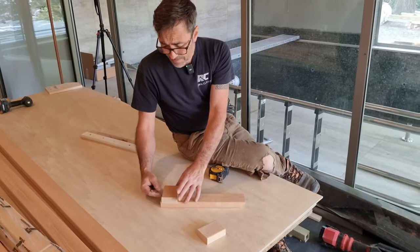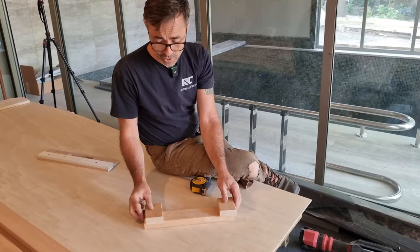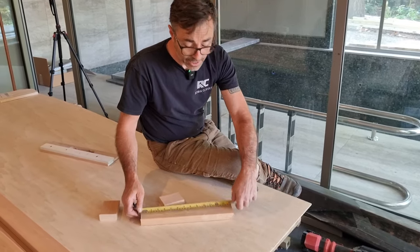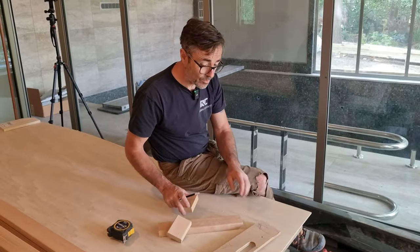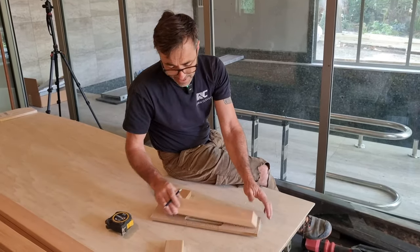I'm gonna have a little gap at the back, okay? And I wanna hang over the front, okay? So the gap at the back and the hang over the front could be exactly the same because when you slide it all over. So let's just take the overall length of the slat for now. So it's 355 millimeters. All we need to do to set that out, get a bit of scrap wood. In fact, this is perfect. This is the length we're traveling here.